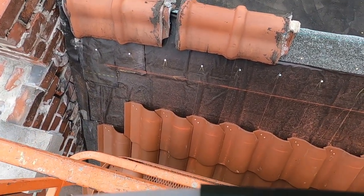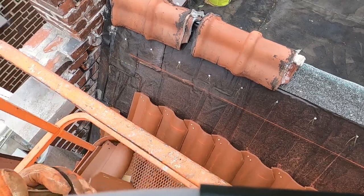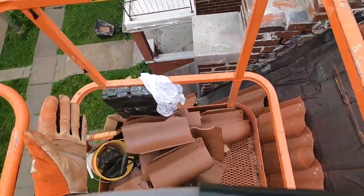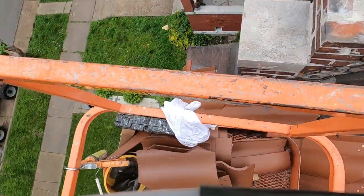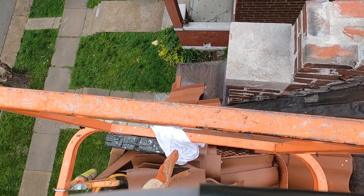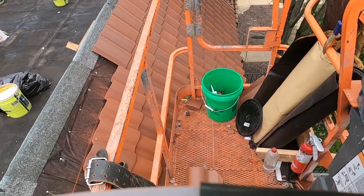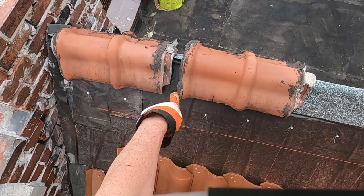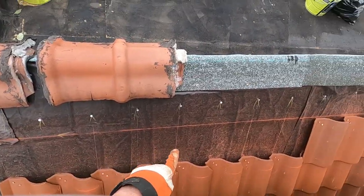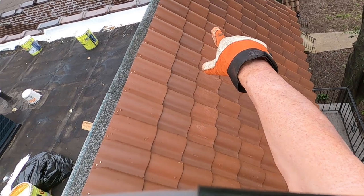What happened is I framed the first one out even with the fascia down there, and then I put the eave closures so that the first tile was 2 inches. And what that did is it dropped this side of the roof down a bit. I'm surprised it's only a half inch. So I measured 13 and a half inches down and chalked a line, and that's what it is down here. I don't know if you can see, but it says 13 and a half.